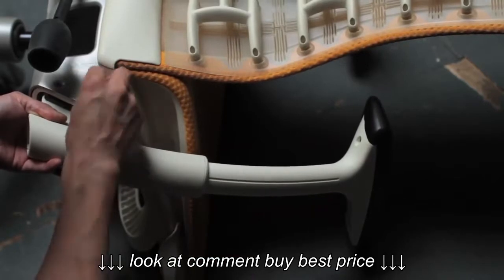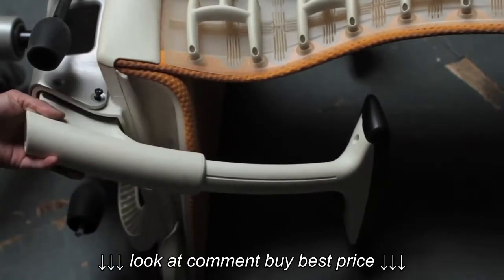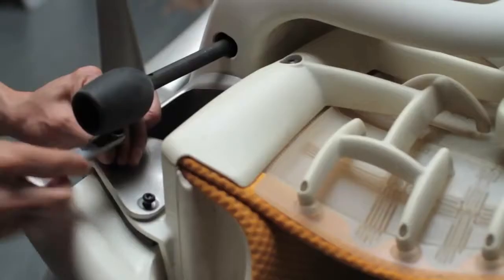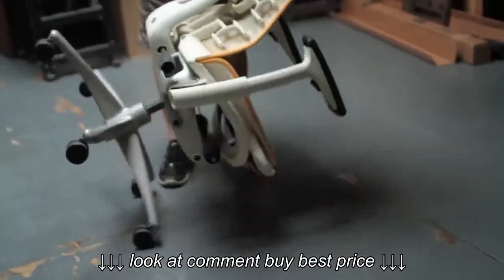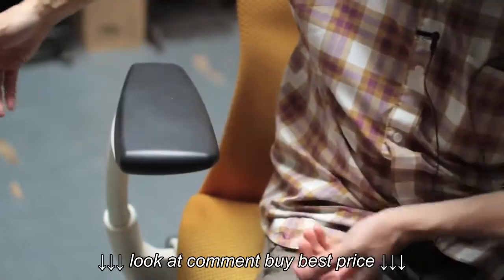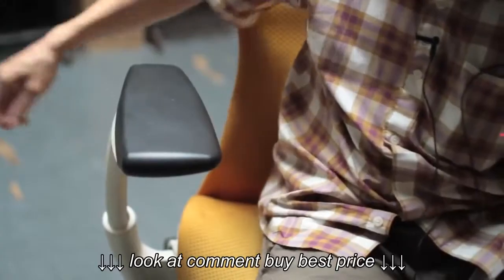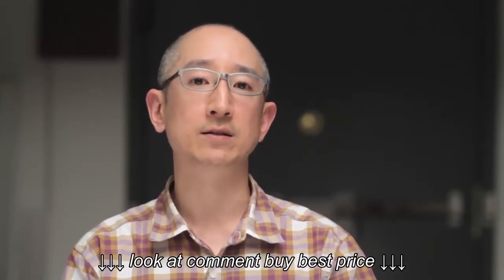Whenever you're remounting something that requires two screws, it's always a good idea to thread the first screw in just enough to get registration, then thread the second screw while you've still got some wiggle room. Once you've got them both registered, you can tighten both of them down. And that's it — now let's see if it works. Good to go. Hopefully this video will find its way into a Herman Miller designer's inbox and they can possibly address this issue in future designs. Thanks for watching, I'm Rain Noah for Core77TV.